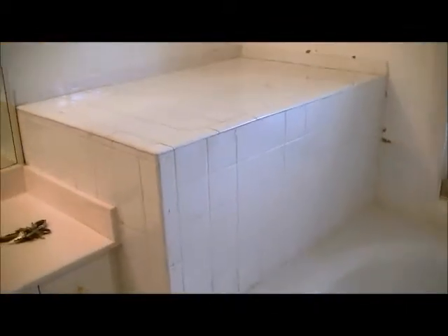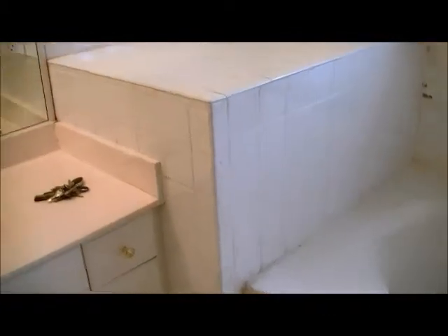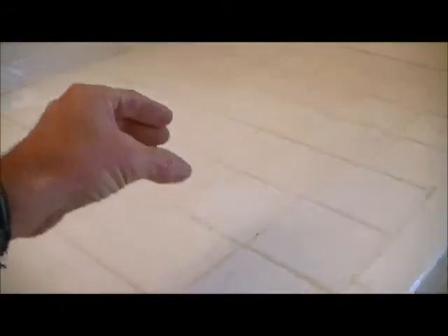We have a big old box here which is kind of odd — it represents nothing but wasted room. There is an access panel in this closet to get to the jacuzzi motor, but otherwise this box is absolutely useless except for filler. There's no linen closet, so my suggestion was to make this useful by putting a 2x2 cutout with a hinged lid, framed out nice and neat, with shelves inside to store towels and wash rags.